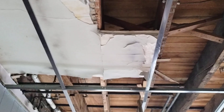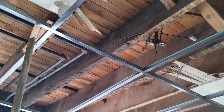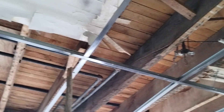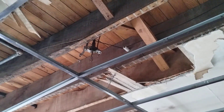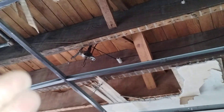This was not observed - none of these fractures were observed with this drop ceiling that was installed. But I said open it up for safety reasons, because part of it was just old ceiling. So I put my finger on it - it's got to come down for safety reasons. With that said, all of this became exposed to us. Originally I thought no bridging, and then we got further back and we see the bridging. That's good for helping prevent twisting.